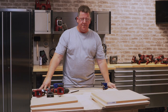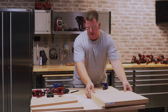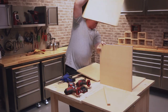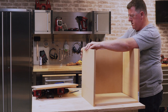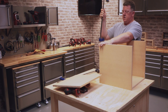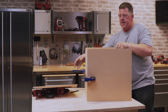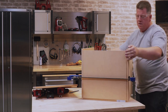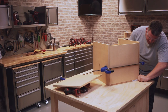Out of those six pieces we have, we're only going to use five. We need four that are exactly the same, and the fifth one will be the back wall. Stand everything up. Now we need some nice big clamps — one clamp at the back of the box like this, not fully tightened up because then we can adjust our walls and our sides.